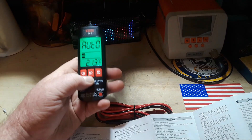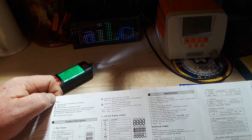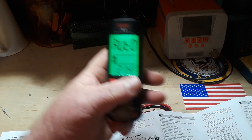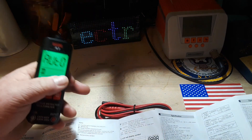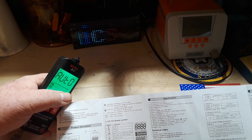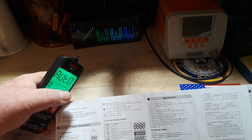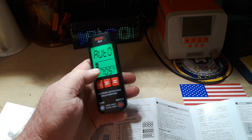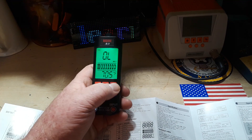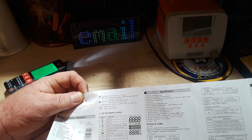The center button has a V-alert and temperature function on it. Long press changes the units from centigrade to Fahrenheit - long press it - there you go, 70 degrees in here. Short press toggles non-contact voltage sensing between normal and high mode. Then long press on the flashlight button toggles the backlight on and off, and short press cycles through live, resistance, and continuity modes.